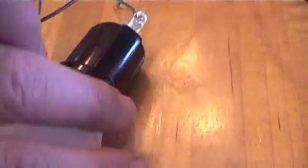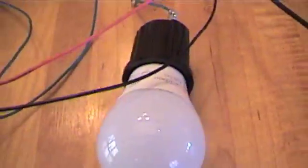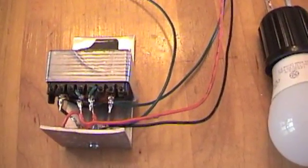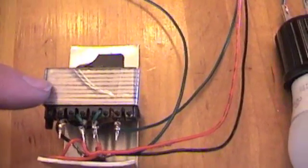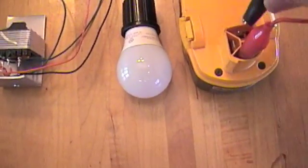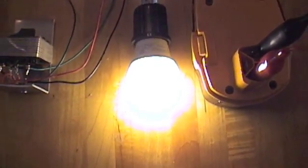Let's see if it works. You didn't think I would have actually tested this before I filmed it — this is all live. So we're getting ready to test, we've got wires hooked up. Now, we've done everything wrong: we've used a scrap E-core, I'm using the wrong transistor because I happen to have an old one sitting around, we're not using the right wire — we're using some bell wire and some 30-gauge magnet wire. So we're doing a lot of things wrong here. And we will fire it up. Let's see if it works. Hey — it works pretty good!